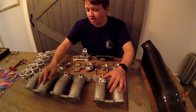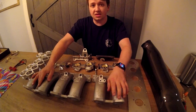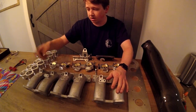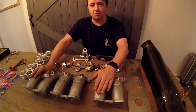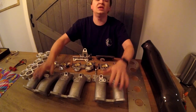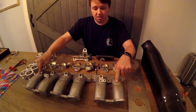What we're going to do next is take these outside — I have the grinder hooked up. We are going to grind down the rough spots and get everything kind of cleaned up. Then we'll bring out the Dremel and dremel all the little areas. Get everything kind of smooth and clean. We're going to powder coat these black so that everything is cohesive in the engine bay.